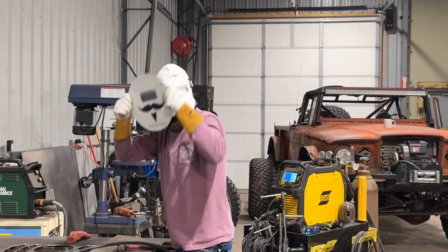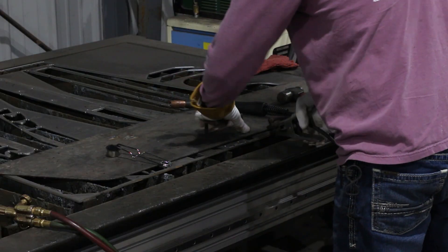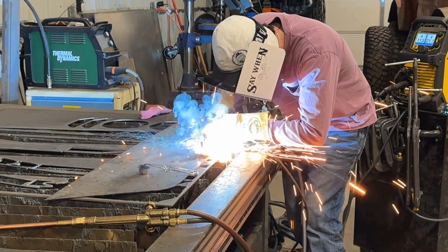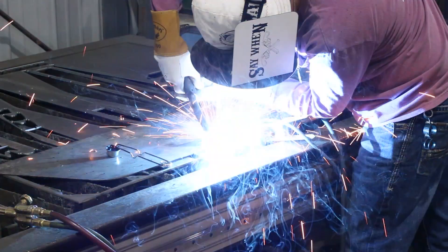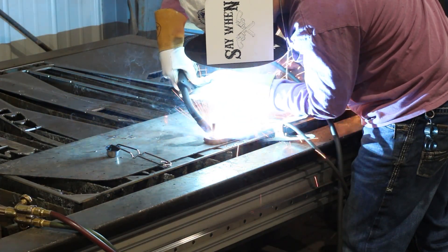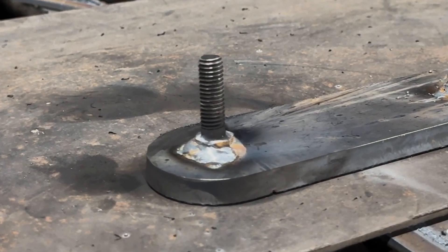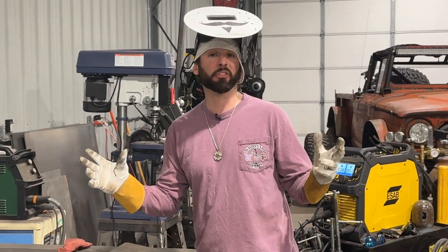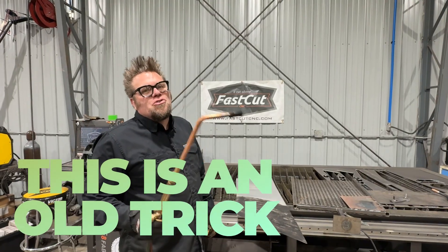405 AC/DC hooked up, ready to go with some MIG — throw some BBs. It's basically snowing on us. Now we've got our bolt welded up nice and solid. See, there's no spatter on it, and it just wipes right off. You can thread anything back on it — no damage to any thread whatsoever. It doesn't have to be threads; it works for any spatter basically.